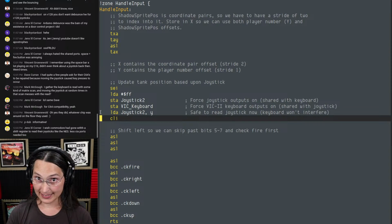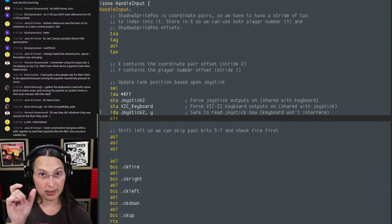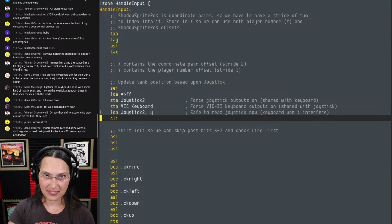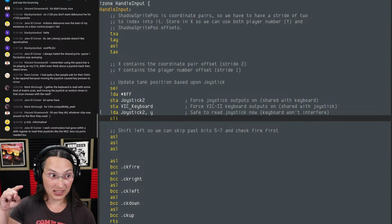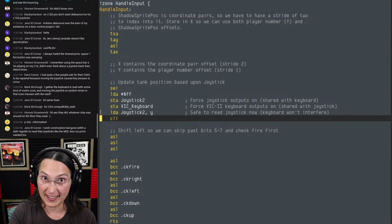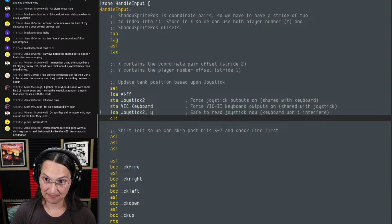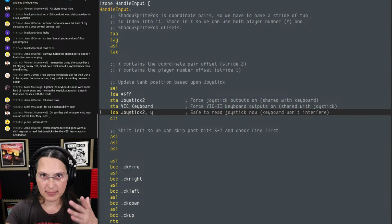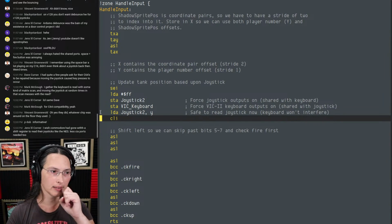The thing is, that's still adding more chips to your BOM cost. So if you're going for bottom dollar, you don't do debounce, you don't do shift registers, you don't do any of the fancy tricks that the NES did. You do it bottom dollar. You raw connect those pins to your CIA chip. And incidentally, they didn't even put ESD diodes there, so whenever you're plugging things in, you've got to be careful because you might actually shock it. But yeah, we do this inside of an interrupt protected area because, again, we don't want something else messing with these registers. And so we put this in an SEI CLI block so that we have an atomic read.